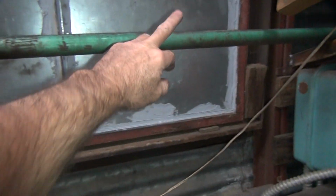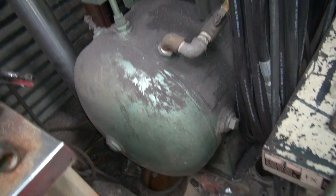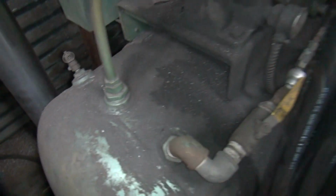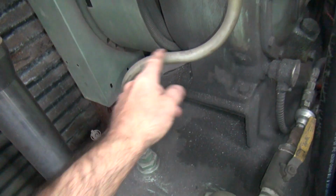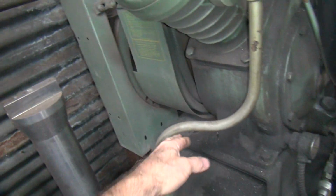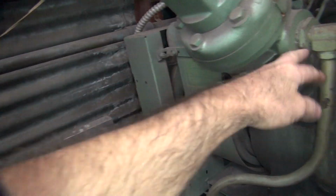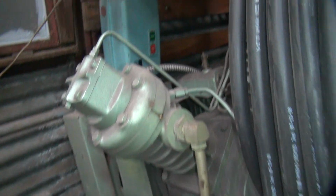And then coming down from here, I don't have any flex tube between this and the tank. Technically, I don't think I need it because this shouldn't be vibrating too awful much, maybe. Who knows? Because this is solid out of this, it probably all shakes. So anyway, I'm going to wind up using this flex joint right here, which is a piece of either copper or steel. I'm not sure. It's not rough. It doesn't look like it's copper, so it's probably steel. So I can put a little bit more of a bend in here if I need it to, and I'll come off with a hard piece of pipe from here down about here, and then just reverse this and go right in. And that'll give me an air-cooled water source, or air source.